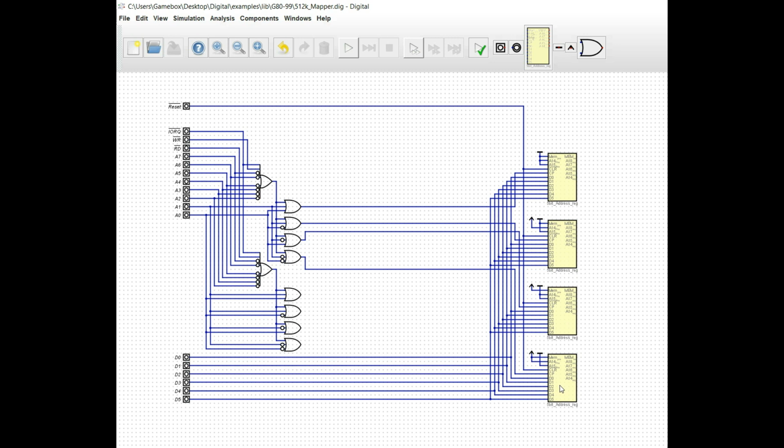So I guess it's about 24 macro cells that we've used, but I can assure you that with this small amount of logic, we're not going to have any higher of a utilization within the CPLD than what we currently have with just the flip-flops. So this allows us to utilize a lot of that logic that's already built into those macro cells that we've already used just by consuming those flip-flops. And because of that, now we're able to both write data in, and soon we will be able to read that data from the register as well.